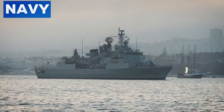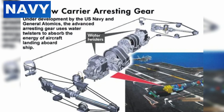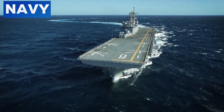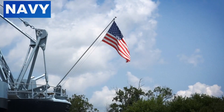Technological Advancements and Future Improvements: The most notable development in aircraft carrier arresting gear is the Advanced Arresting Gear (AAG) system, which utilizes electromagnetic technology instead of traditional hydraulic systems. This allows for more precise control over the deceleration process, adapting dynamically to different aircraft weights and landing speeds, resulting in a smoother, more reliable arrestment process that reduces mechanical stress on both the aircraft and the cables. AAG's electromagnetically controlled braking system requires less maintenance compared to hydraulic systems, reducing downtime and increasing the carrier's operational readiness. The AAG system also integrates advanced diagnostics that continuously monitor performance, allowing for predictive maintenance.